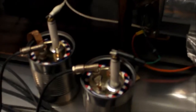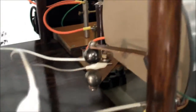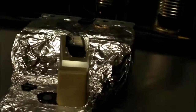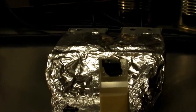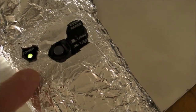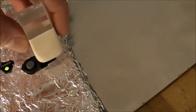Here's the setup: I've got the differential probe hooked up directly to the terminals of the rotary spark gap, with a very thorough ground connection. All the ground connections in these cables are hooked up to the ground plane. On top of this is a little glass prism so I can easily monitor from a distance the over-range indicator LED, in case there are any extreme voltage spikes potentially damaging to this thing. I also need to change the range button so the total voltage division is going to be 10,000 to 1.